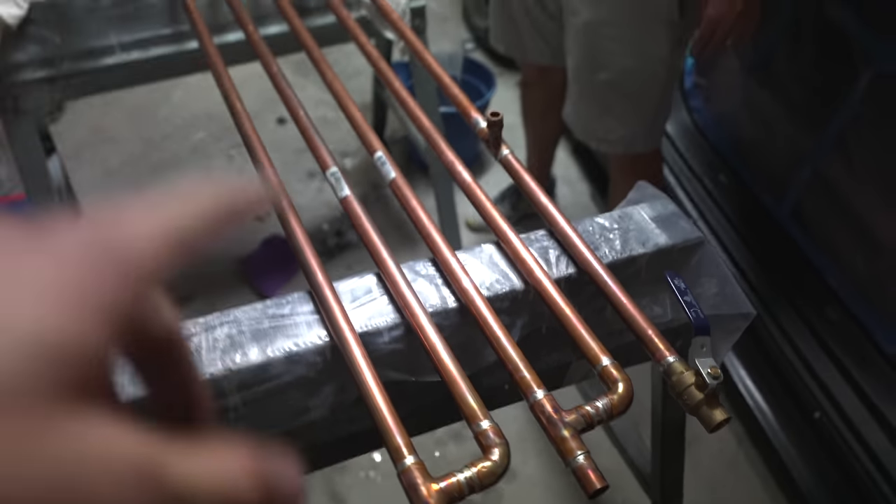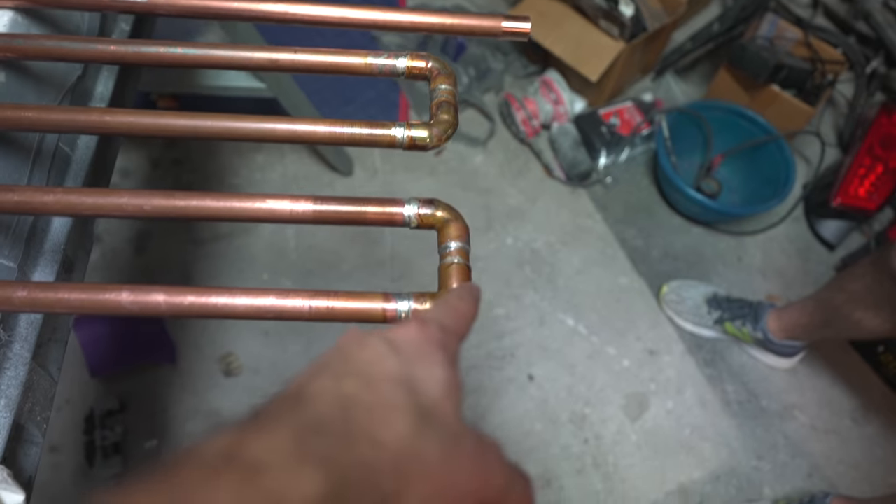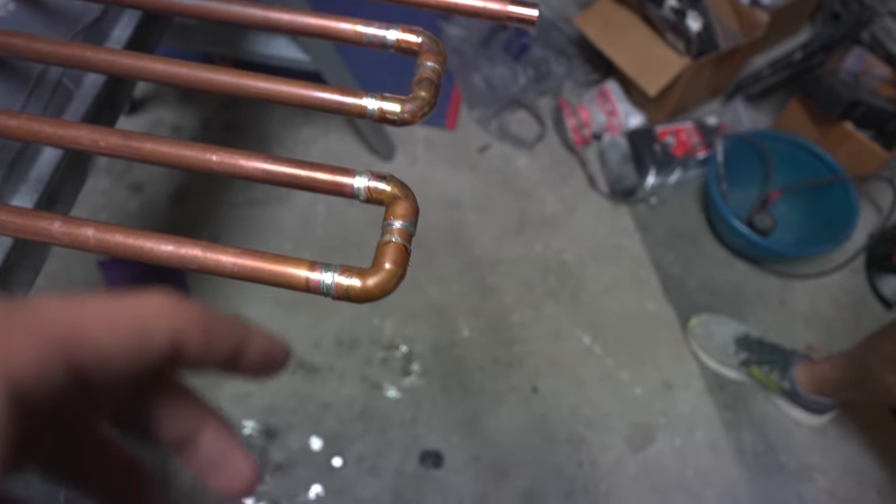Besides the safety aspect my dad is applying tonight, we've been trying to finish up the copper soldering for our water trap. We don't even want to get into our initial troubles where I put in the wrong pipe length — we kind of ruined it twice. We reheated this section and put the right length in. From my research, if you reheat one fitting you have to redo the solder for the other side, but I think we'll be all right — we can test it and see.